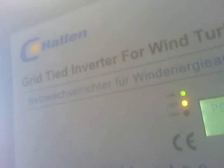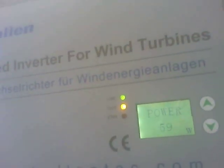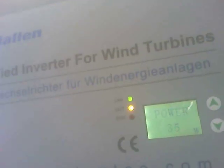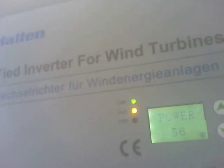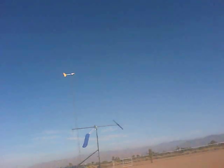Wind picked up again. Once it drops down around zero or so, it'll have to go through the whole process again of reinitializing the inverter and running for 30 seconds without being loaded down. Now it looks like it's not going to let go right now, so it's running well — loaded down, might be loaded a little too much, but it's making decent power for just a light wind. It's doing okay.